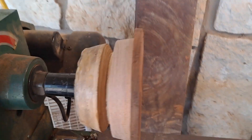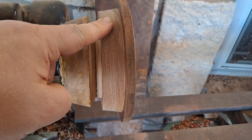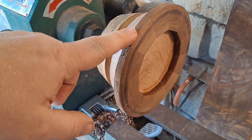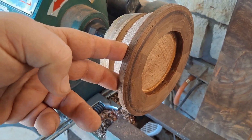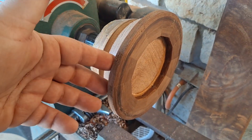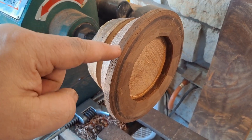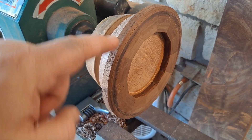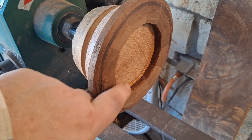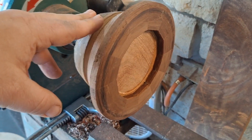This is the mesquite bowl that I added a bottom to. I had this ring already glued up — it was used on another project, so I'm going to reuse it along with the rest of it. It should come out pretty nice. It's going to go a little faster since I'm not cutting new pieces; I'm reusing old material, but it'll make a nice product. I'm going to true this up to make sure it's centered and round, and clean this up as well, so when I glue the next one I can line it up without any wobble or pattern shift.